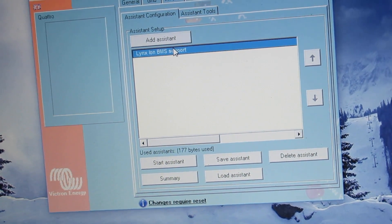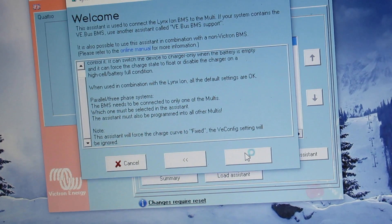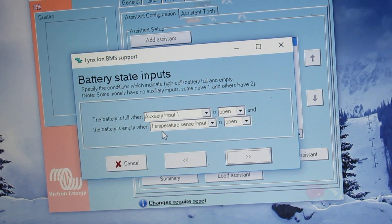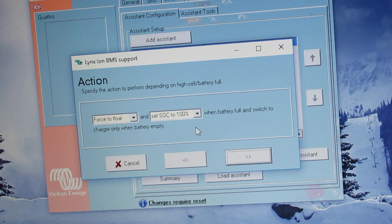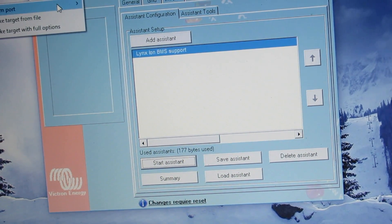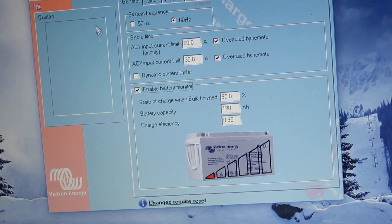If you look at it, I can just start it here — it tells us what it does. We just go in here and click through. We have separate contacts so we're going to use the auxiliary and the temperature sensor instead of the regular voltage and temperature sensor to run the BMS for lithium, because it's different than regular ones. Forced to float it, and the state of charge is at 100. Then you would just go here and click save settings. If your port selection's open and your COM port's there, you just send settings, it'll restart both things and you are good to go. So that's how you set up your two-phase split-phase system.